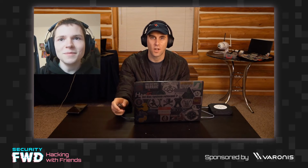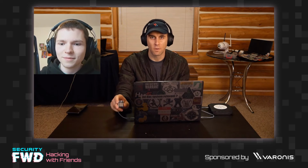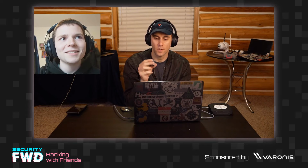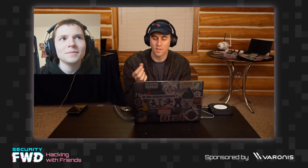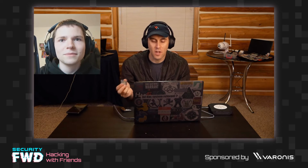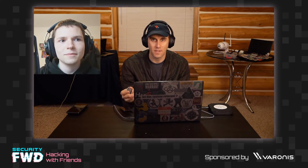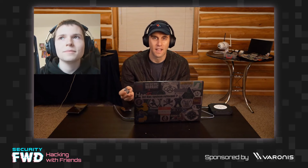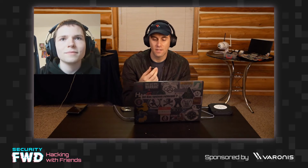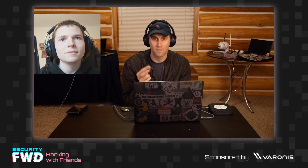So for anyone who's just getting started with microcontrollers, this all might be a little bit confusing, but when we're talking about more expensive, the microcontroller I'm holding, which is an ESP32 development board that's quite small, costs about $5, as opposed to maybe $2 for an ESP8266. So when we're talking about expensive, we're talking in pretty relative terms, because this is still half as expensive as the cheapest Raspberry Pi. And that's not including all the accessories you would need to actually work with that device. So this doesn't need a micro SD card in order to get started on it. It's a pretty powerful little device for about $5.